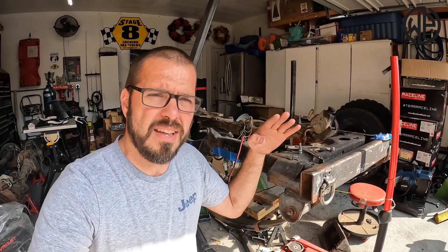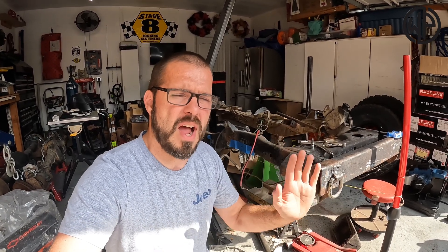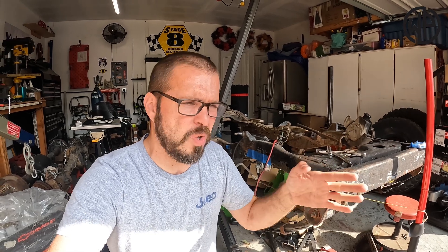I'd like to take that rise I had in the new frame and carry it farther forward — raising the front bumper just a little bit more, similar to the front half kits you see for TJs and YJs. It gives you a better approach angle. I'm not overly concerned about approach angle because with the amount of stretch I'm putting into this Jeep, my front tires are actually going to stick past the front bumper. But having a slightly better approach angle in the front is nice, because sometimes rocks hit your front bumper even when your tires are all the way out in front.